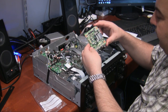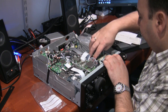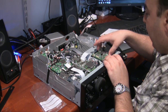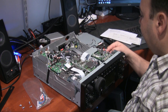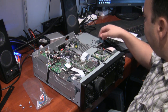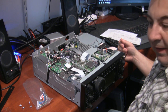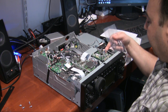The board locates on two lugs — there are little lugs at the front and one at the back — so it's basically not possible to get the board in the wrong way round. They are polarised so you can only go one way. The board mounts on the four points with the polarised pegs and then you screw it down. That's the board securely down, and the next thing is to connect up all the DC cables, signal cables, and control cables from the module. The diagram is well documented in the manual so you can't really get that wrong.